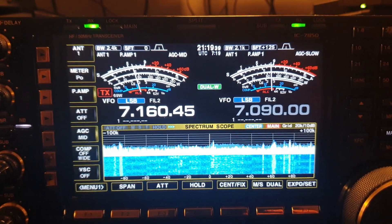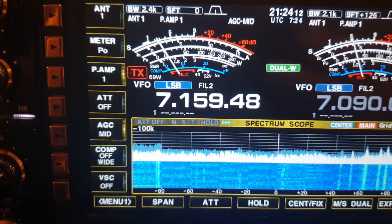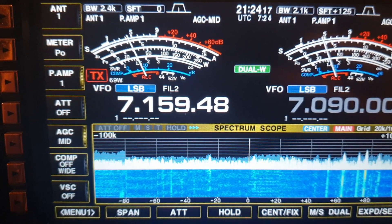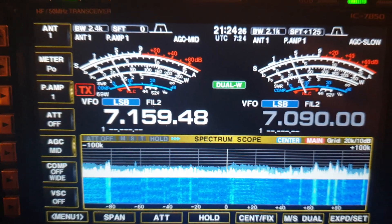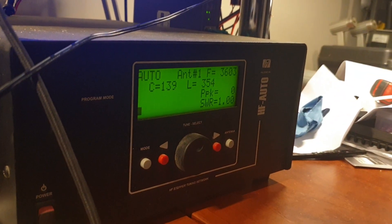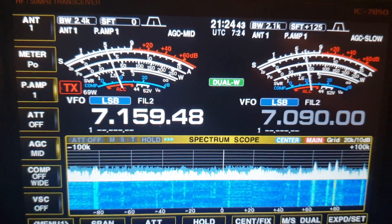I'm really just playing around tonight. We've now got one on the back of the antenna tuner - there's still sparking up a bit there. Now have a look at this - this is very interesting! That noise level has dropped down to about S3 to S4. That sort of says a lot. We had very little effect when we put it in the back of the radio, but on the back of the antenna tuner here, that has made quite a bit of change. Very very interesting. I'd like to do some tests on 80 meters as well.